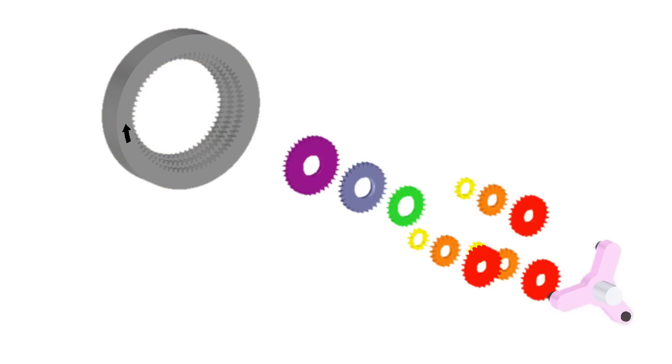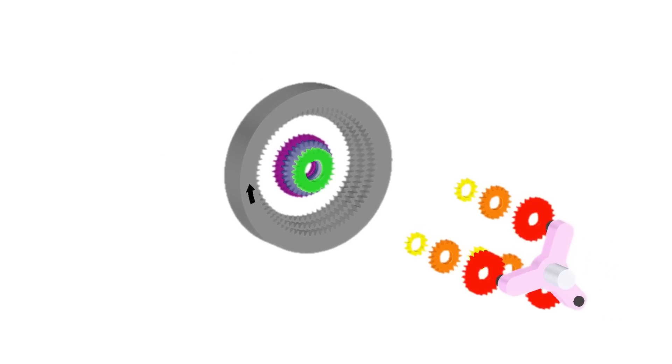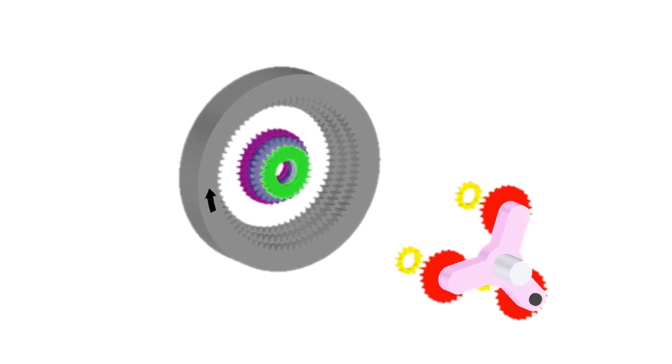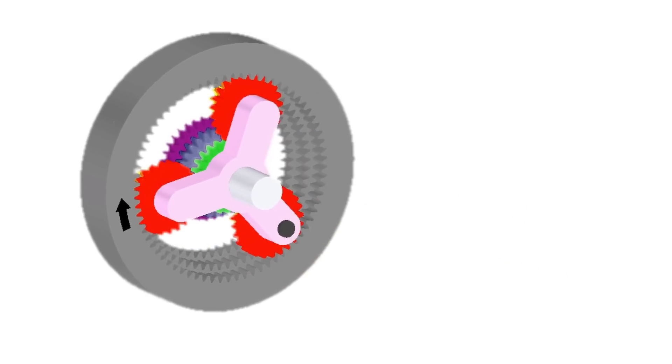Let's look at the gear apparatus. In the apparatus we have three different sun gears mounted on the same shaft. We also have three different sized planetary gears and three different sized internal ring gears. All the ring gears are essentially bolted together — roll pins or whatever — keeping them all together so they all turn at the same rate.